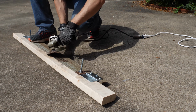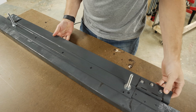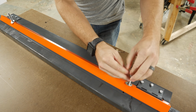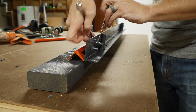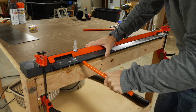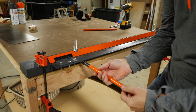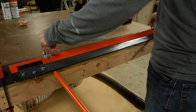A lot of the steel that I was using was reclaimed from another project, and it was covered in lots of old paint, so I had to grind all of that off and then spray paint all of my pieces into new colors. After that, I just reassembled everything with the nuts and bolts. I left extra space on the end of these 2x4s specifically so that I could clamp it to the table. This makes it temporary but also useful. Rather than masking them, I painted the entire rods and then just pushed them into the sockets, which tore off the unnecessary paint. I pushed it away and then these were ready to go.